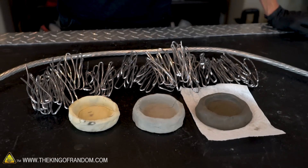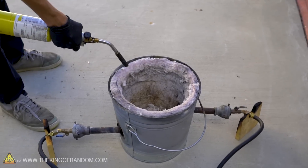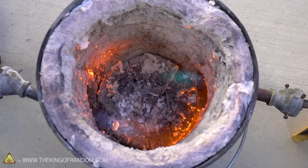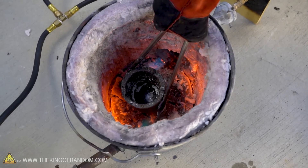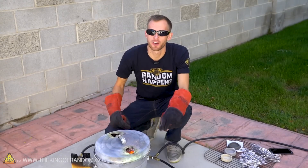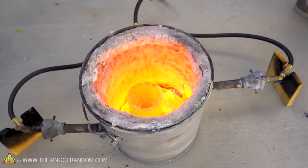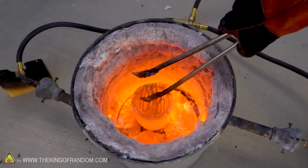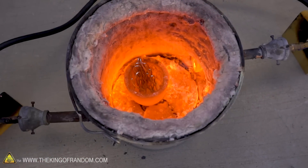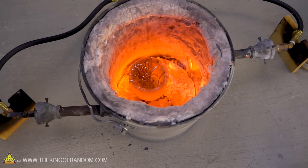We have our aluminum and our three types of clay. Let's go fire up the foundry and start melting some metal. We've got our backyard foundry and our crucible for the aluminum — let's light it up. Holy heat, it's toasting my finger right through the glove. Our foundry is going, and the crucible is bright orange, so let's start adding aluminum. You can see it starting to melt already. It just melts into a puddle — looking nice and liquid.